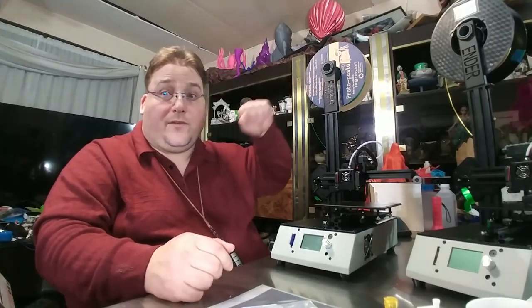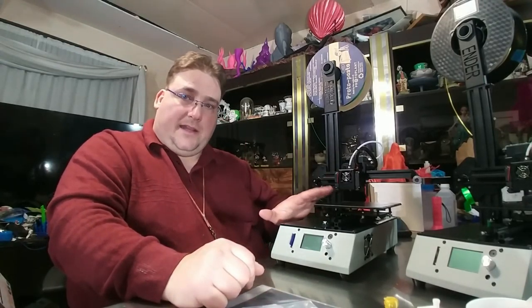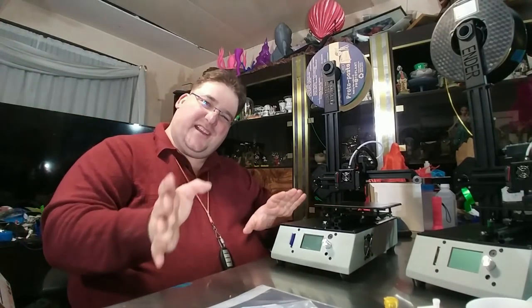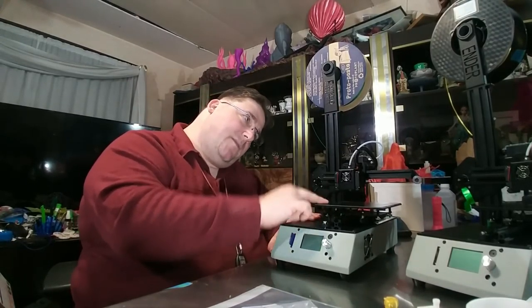I would go to 225 millimeters, like the Ender. The Ender is rated for 200, but it can really go to 226. So I go to 225 as a max, because that will dramatically expand what you can print with this. Because there's a lot of things that we print that are taller. Now maybe that's just me. Maybe there's no market for that, or the Ender 2 fills that market just fine. But just an idea, if they want to make a Michelangelo Plus heated bed, taller Z.